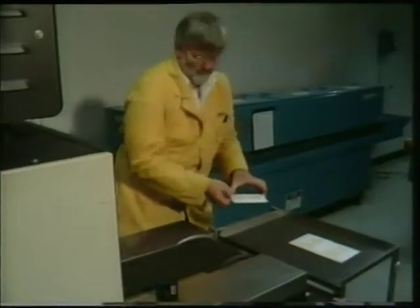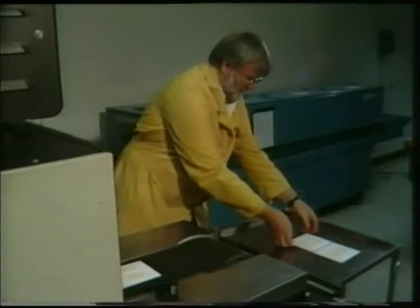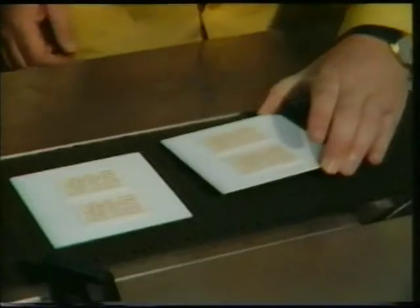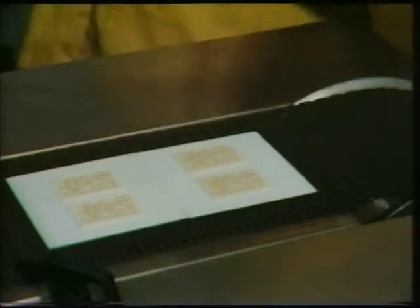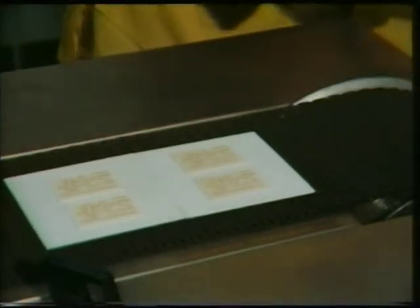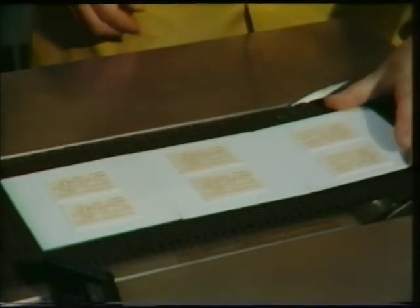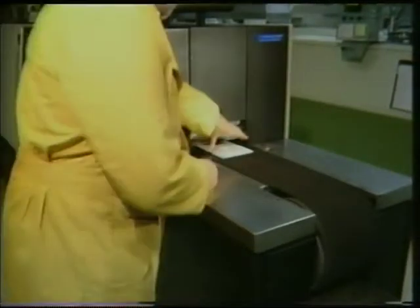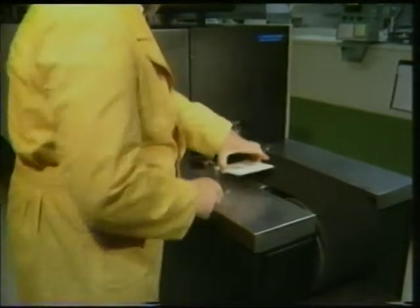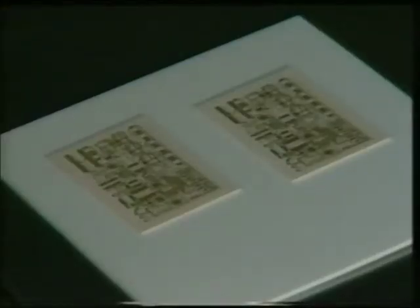Now, with at least 85% of the organics burned out, circuits are ready for firing. The circuits, still on alumina substrates, are now transferred to a conventional thick film belt furnace for firing. Firing is done in a standard thick film furnace set for a 15-minute peak temperature of 850 degrees C. In this final step, the green tape becomes a piece of monolithic ceramic, with multiple layers of conductor and resistors hermetically embedded within.